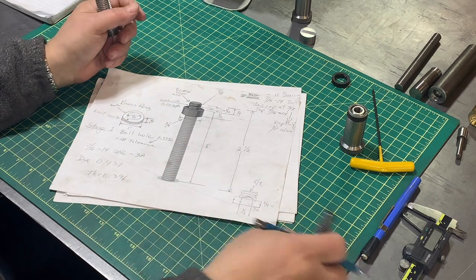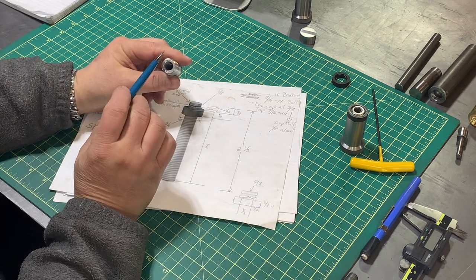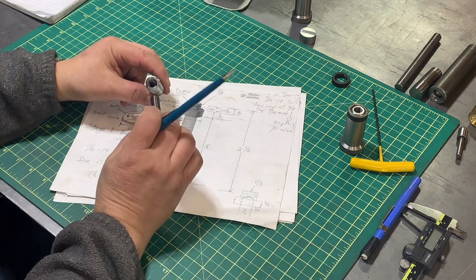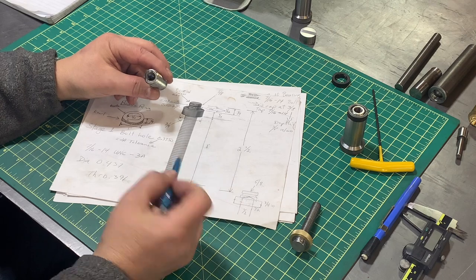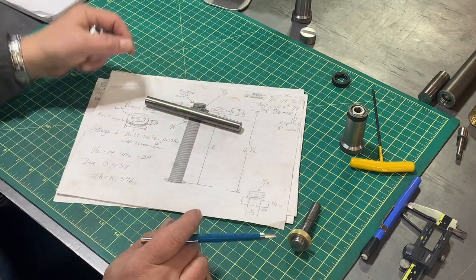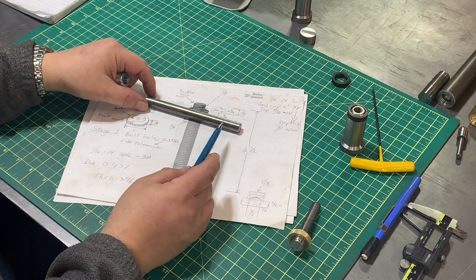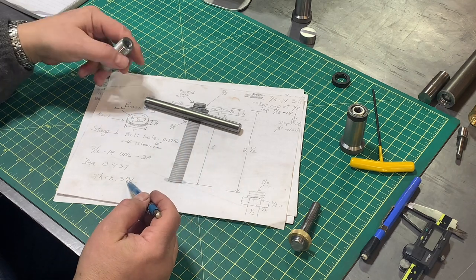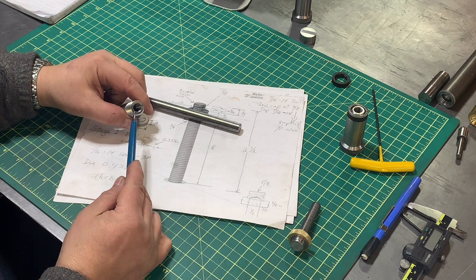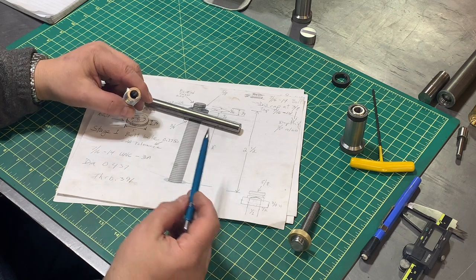Okay, so before I make this stage two bolt to fit inside this stage one bolt, I know I want my bolt to fit in there and be relatively snug. And what I'm gonna do is take a 1/2 inch stock right here and turn that down to 437 thousandths. And then I'm going to turn threads until I reach a pitch of 391 thousandths. And once I do that, I'm going to start using this stage one bolt to see if it fits. And I'm going to keep turning lightly until it does.